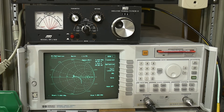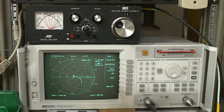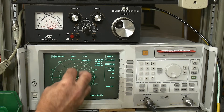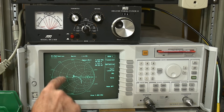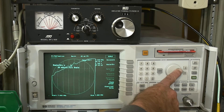You can think of a Smith chart as a bullseye — you're trying to get to the center, where 50 ohms is. Concentric circles away from that center are lines of constant SWR, so you want to be as close to the center as you can. For this particular frequency where I had the marker, you can see we're right there at 50 ohms. We can even zoom in a little bit on that.